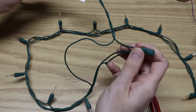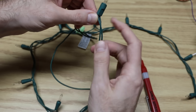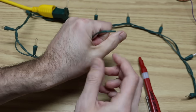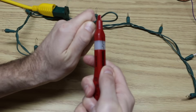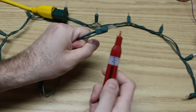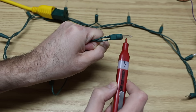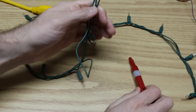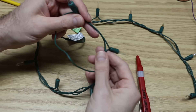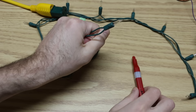Now I know I've got a hot connection starting here at the beginning of the chain of lights, going light to light — and this wire will be neutral. Let me double check that: I'll shield everything below and I'm not detecting on that side. So I come back to that first light — it should be hot. I can actually go right up to the light bulb because that's where the connection goes. We know we're good here; we're getting a hot connection. I'll go to the next light, separate it out so we're just getting the main wire.